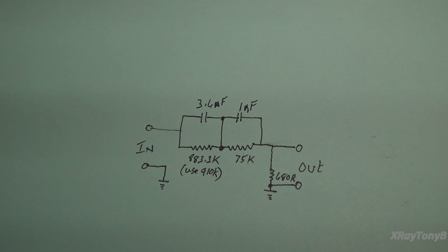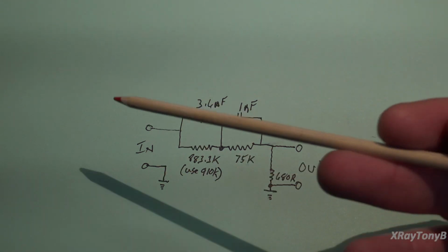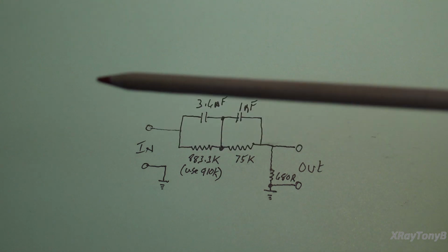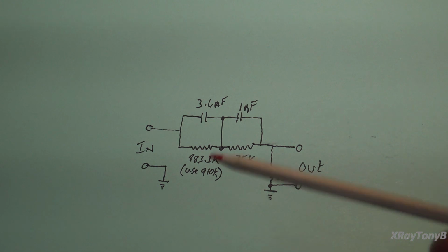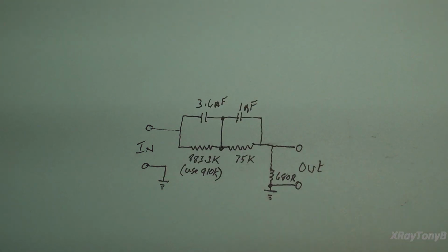And there's lots of information online how to design them, how to build them. They're very simple. But there's a couple of other problems with this simple design here. One is it doesn't take into account the amplitude of the device that you're feeding into it. So for instance, the output impedance and the sheer amplitude of a line stage signal, like the output of your MP3 player or a tape deck or something like that, is much higher than your phono stage. Your phono stage has way too much gain for that. So you need to compensate for that.